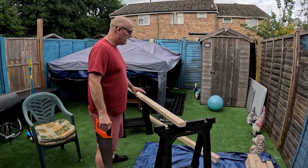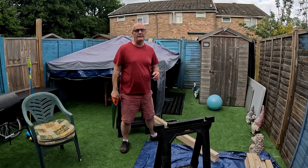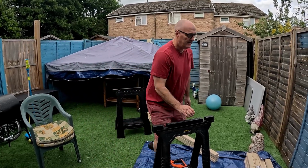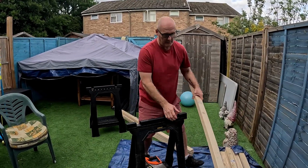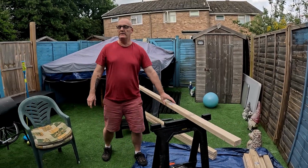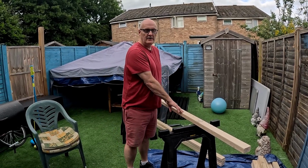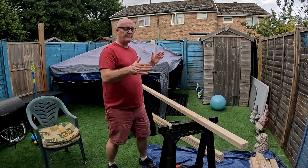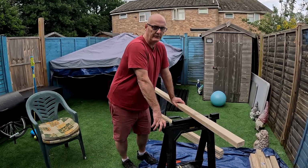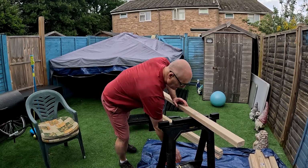So what you have to do is cut how many struts you want for underneath the shed, which I'm going to go for 5, which I think will be enough. Then I'm going to cut more to 6 foot lengths that I've got anyway. Then I will lay 3 bits of the wood flat on top of 3 bits of this wood that I cut to 6 foot length, and fix them in place. So you've got a whole panel, and make up 4 complete panels. And then we'll go from there really. So we'll get on and sort this out.